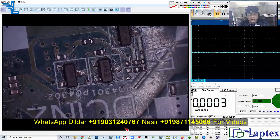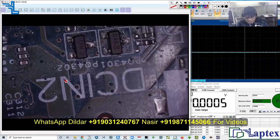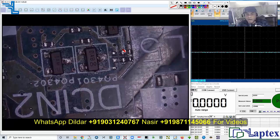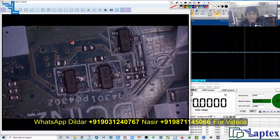Let me show you how much effort has gone into repairing this motherboard. The PS_ID area has been worked on a lot — two MOSFETs, and multiple resistors have been randomly changed. Also the backside FET is changed — why it was changed, what value was used, we need to find out because current values matter. So most components here have already been changed, and somebody has already messed up this motherboard, which is why it is so complicated. The BIOS has also been re-done for unknown reasons.